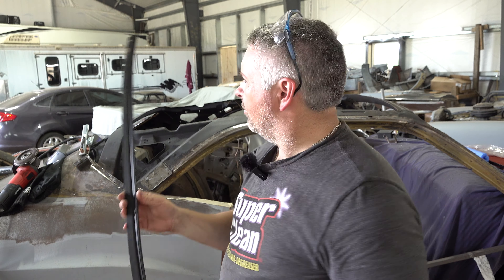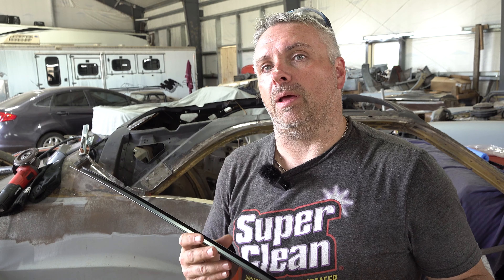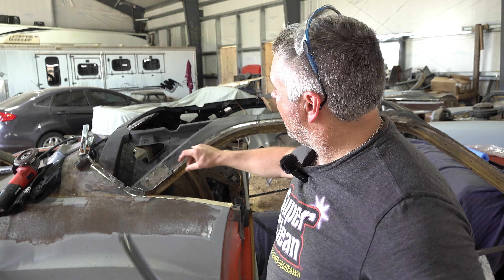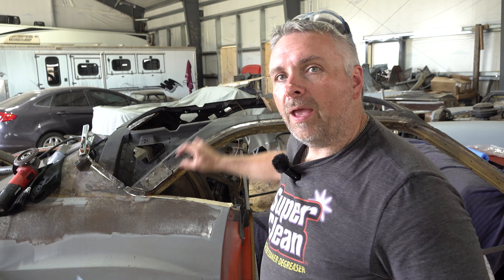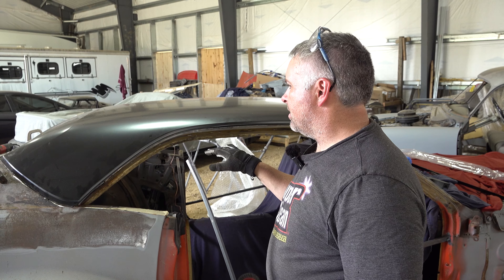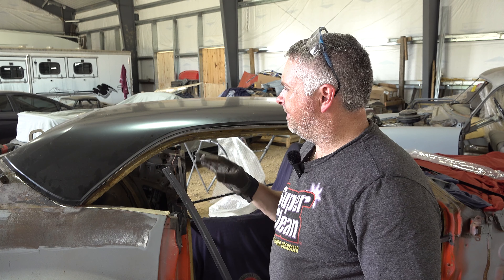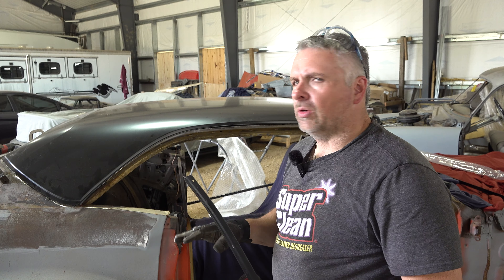Maybe we can set the roof on again, now that I've gotten all the metal prepped, and just mark where these drip rails are going to go. That way when I get that metal for the driver's side right in this area here, I can get that welded in, then we can come back and knock out the drip rails and the roof in the next video. All righty — got the roof back on, not too bad of a job, and actually since I went ahead and prepped and cleaned everything off, it fits a whole lot better. That's really positive to see.